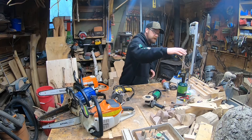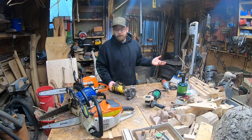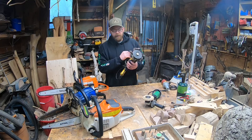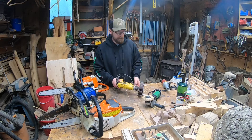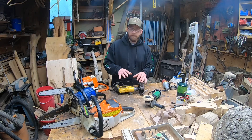So you've got a saw, angle grinder, torch, die grinder plus bits — and then look into getting yourself a drill and a flap sander. You might be looking at the lineup thinking you'd rather have that first, and that's fine — this is just the order I would have purchased things in if I'd thought it out from the start. My flap sander setup is just a half-inch chuck drill with the Sandiflex. The Sandiflex works awesome. You can replace the sanding attachments in here, or make your own. It's great for finishing up your carvings — after sawing you can hit it with the angle grinder, then the die grinder, torch it, and then come through with this at the end. If you don't want to spend the money on a drill and Sandiflex, get a hard bristle brush to brush off the soot after torching before you clear coat.